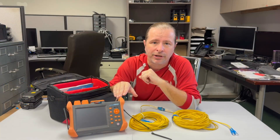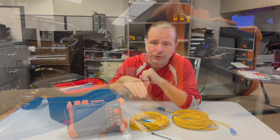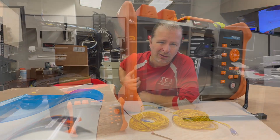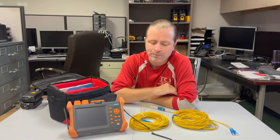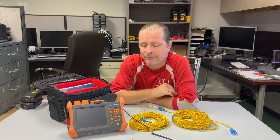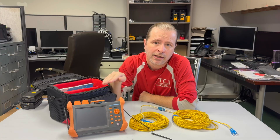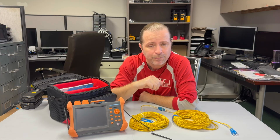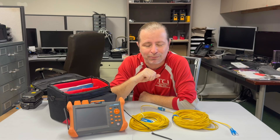The product that I purchased from Amazon is a single mode only device. You could do multi-mode — nothing wrong with doing an OTDR for multi-mode — but for the situations in which I find it most useful I don't really bother with multi-mode. I like to use single mode everywhere that I can, and if I can just make sure with this tool that there's a nice clean pathway without a lot of reflectance events, then I'm pretty happy with it.